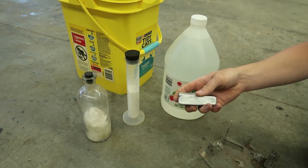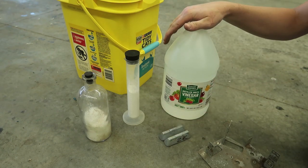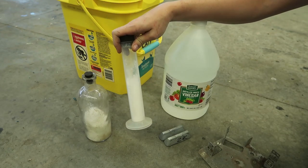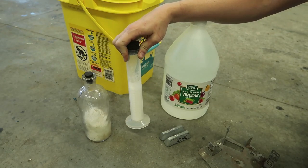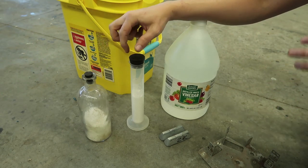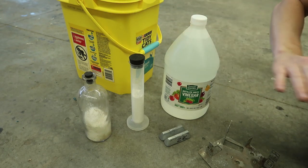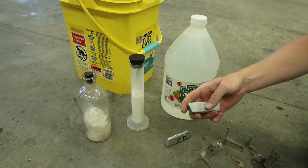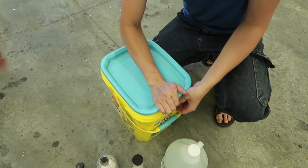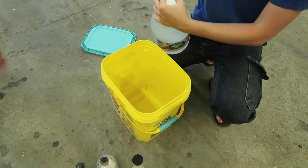It's time to finally experiment with zinc electroplating. We have a pound of zinc, some acid to dissolve it, Epsom salt to increase the conductivity of the electrolyte, and some sugar — because I've heard that sugar can help inhibit the growth of crystals. Without it, the finish would look very matte, but with it, the surface should be smoother with much smaller crystal formation and hopefully result in a more shiny appearance. I really hate the smell of vinegar, so this is not going to be a fun part.